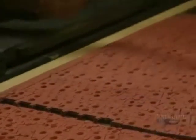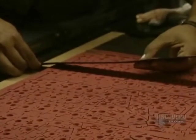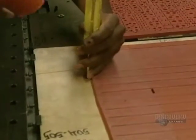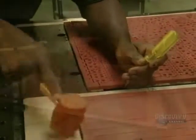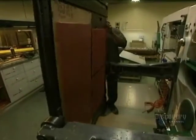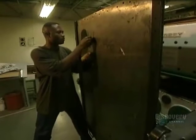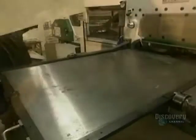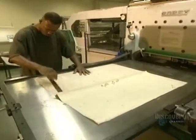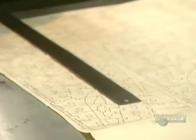It's imperative that the die not move during the cutting. Otherwise, the pieces would be cut at the wrong points, so they very firmly secure it in place. The carbon of the die is positioned — it's somewhat like printing the master. Alignment is again verified, a highly important step which assures the quality of the final product.